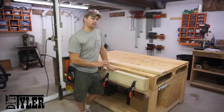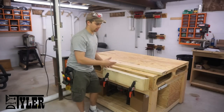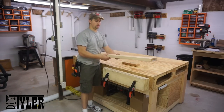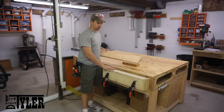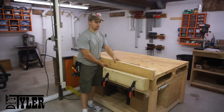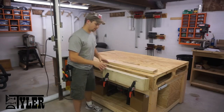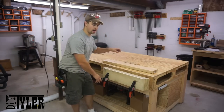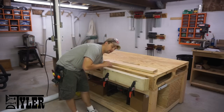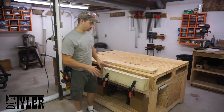The assembly portion of this vise is done and I've got to say, so far so good. Putting the screws in the front worked but it did sag a little bit like I was expecting, though it does straighten right up when you clamp down on the vise. I don't really see myself doing any wide stuff this way. It was a big pain to adjust these bars originally trying to tighten that knob blindly, so I put some marks on the inside of the bar so I have a soft set point. I'm going to do a light sanding and put some varnish on the outside to protect it, but before I do that let me show you how it works.